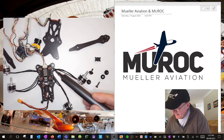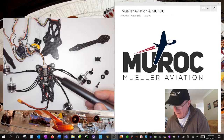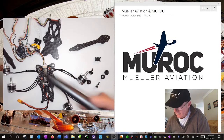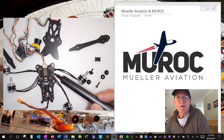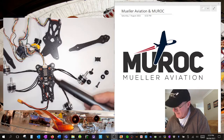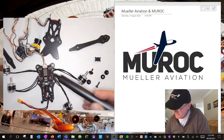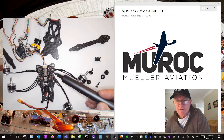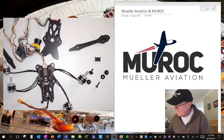So it's brushless. I have to solder these down first off, and then later on when we connect it to Betaflight, the software on my computer via the USB connection, we will do a motor spin up with propellers off, always propellers off for safety, in case something goes wrong and it goes to full throttle and it takes your face off. But in this case, we'll use Betaflight in the software, just with our mouse move the slider and throttle the motors up. We'll see which way they spin.